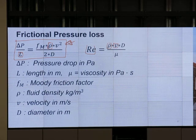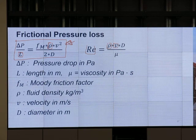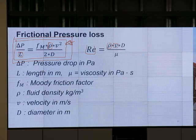Panhandle. Okay. The Panhandle equation is the equation to use for gas. You have heard about this, have you? Panhandle equation. No, not yet. So we have the Weymouth equation, Panhandle equation. That's very good for gas. This equation is valid for gas. Don't get me wrong, this equation is valid for gas, but it requires discretization and some detailed calculation of the change of density and velocity with length. For the case of liquid, it's very good. It can be used for oil.